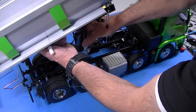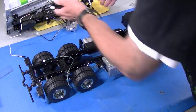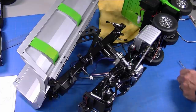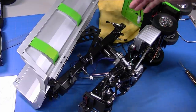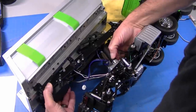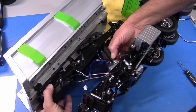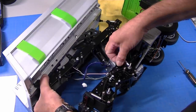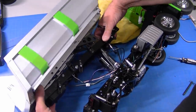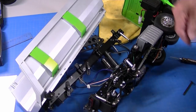The first thing that happens is there's a shaft that goes through here to hold the motor, and I'll have to remove the tires and wheels to get that through. So I'm going to bolt this on and pop off the tires and rims. There's a lot of moving parts here. I plug the switch in and now the motor — the first part is to pull this motor up here and drop this pin through it, then pull the bed down. These brackets here mount to the frame. I'll pull the wiring through later. It's really complicated. I'll start with the motor and the pin — they want me to grease this up as I put it in — and then I'll bolt those side frames down.